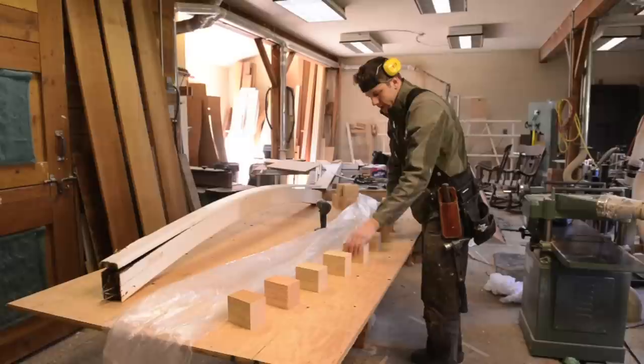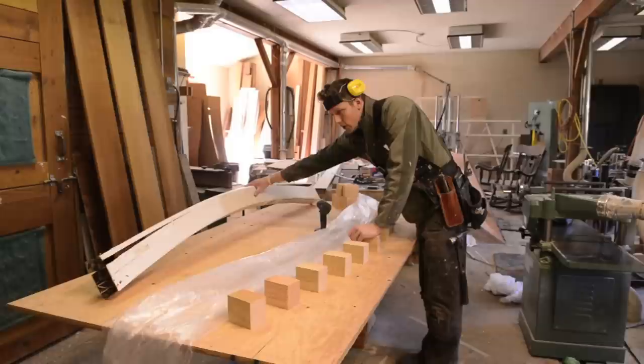So I've got my form built. Just use a piece of 3/4 inch plywood here. Screwed some solid blocks on, 3-inch screws from underneath, along my radius, which I just traced from the old handrail here. That's delaminating, trace the underside of the curve.